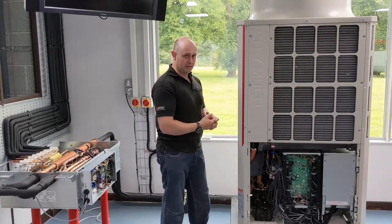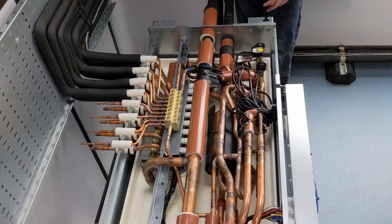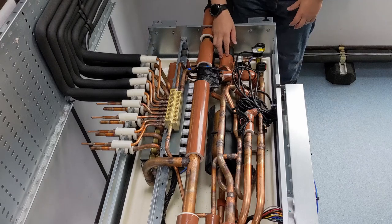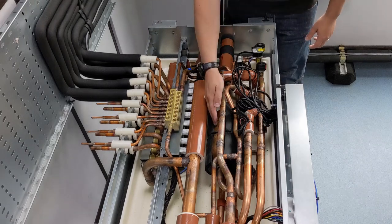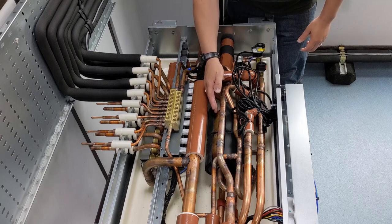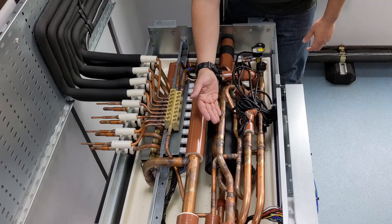I'm going to bring them both together and send them down the same bit of pipework to the BC box. So I've got this mix of gas and liquid passing down this pipework. It's going to stay the same until it gets to the gas-liquid separator, where there's an enlarged bit of copper with a slight pressure drop — at which point the liquid goes to the bottom and the vapor goes to the top.